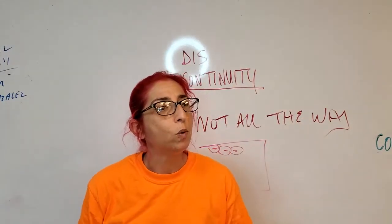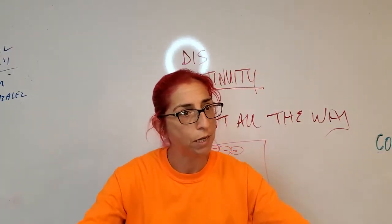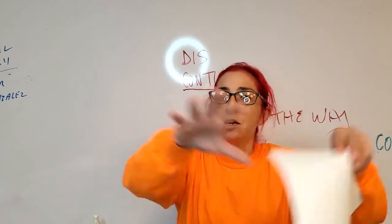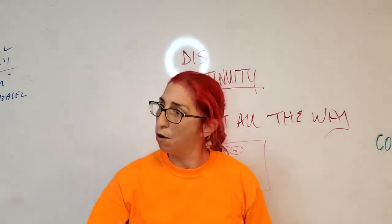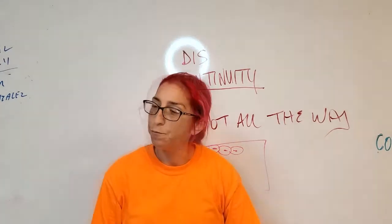What this means is we have no atmosphere around our weld. When we do stick, the flux creates that atmosphere. When we do flux core, it creates that atmosphere. When we do MIG, the gas creates that atmosphere. When we do TIG, the gas creates that atmosphere. So we're protecting our weld. Should it blow away, or should we be too far away, we're not protecting our weld anymore. Makes sense, right?